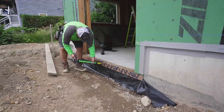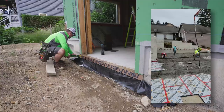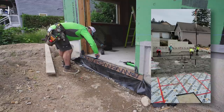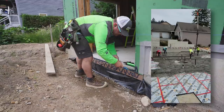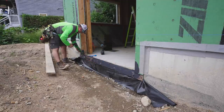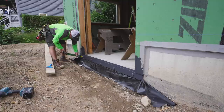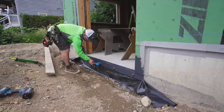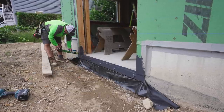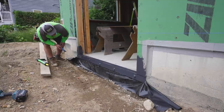This is liquid flash in a sausage pack — that's a sausage gun. Because of the way we're thermally breaking the slab from the exterior, I had to bolt a piece of pressure treated wood that will hold the slider. I used excess five-eighths Simpson Strong-Tie Titan bolts and put some PVC membrane behind that as well, which gives us an option for further waterproofing when we pour the patio. This is liquid flash — it comes out like very thick caulking and you just tool it around everything. I used this because it's the weather side of the house under the deck, and all the irregularity to the shapes made it the right choice.